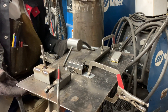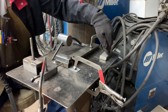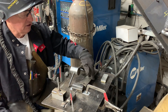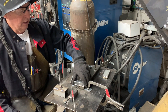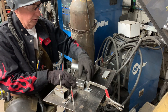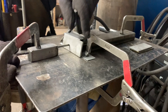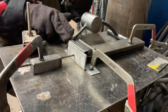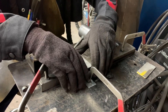I've got a telescoping tube with a plate on it, and my material is all stacked up and ready to go as I work. There's a fixed stop on the left, then a blocking element to position the parts vertically. I have a little spring-loaded TIG fixture that I made, and I've got tubing set up in there to lift the part where I want it.